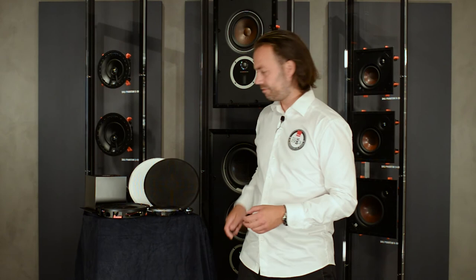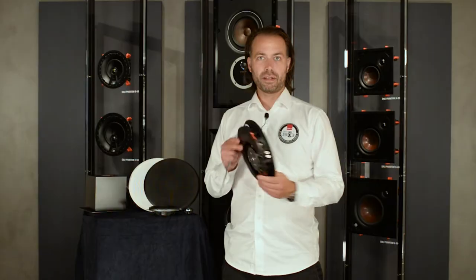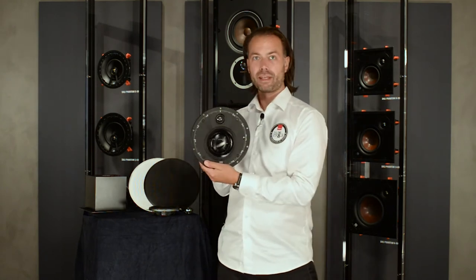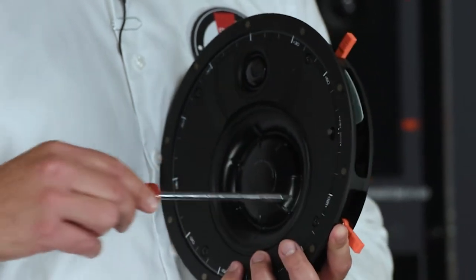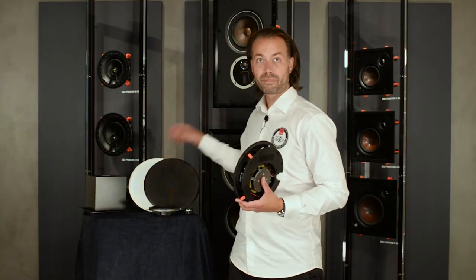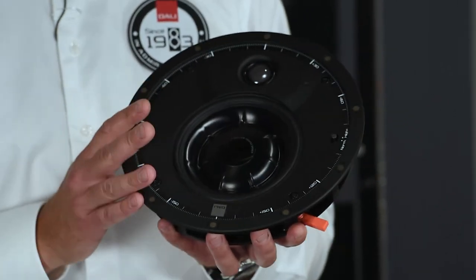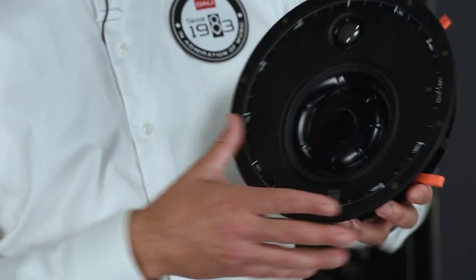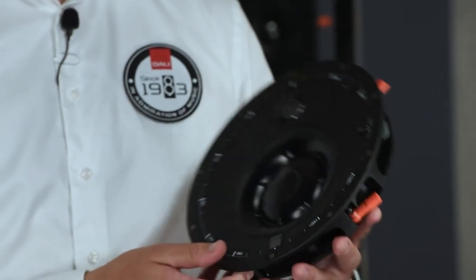The K60 LP is also very easy to install. The dogleg mounting system makes the installation process very easy — simply insert the K60 LP into the prepared mounting area and from the front of the speaker tighten the four screws to swing out the doglegs and secure them behind the mounting surface. The doglegs accommodate board depths from 11 millimeters to 27 millimeters, supporting just about any common ceiling installation. The compass positioning system makes placing the speaker for optimum sound extremely simple — just insert it into the hole, lightly tighten the doglegs, and twist the speaker to the correct angle for your preference.